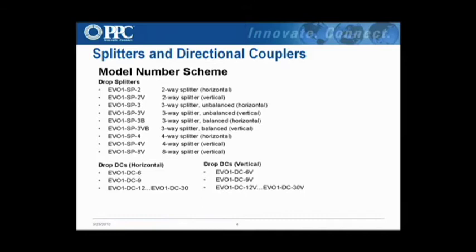As far as the directional couplers go, you can see at the bottom there's a wide range of values offered. Typically the 6, 9, and 12 dB values are the most commonly used — it rarely, if ever, goes above 12 dB. A directional coupler is basically a splitter, but it has a through leg with very low loss and a tap leg. That tap leg is where the value comes from — the 6 or 9 dB figure is the loss in that tap leg.